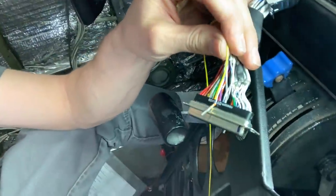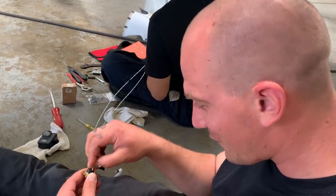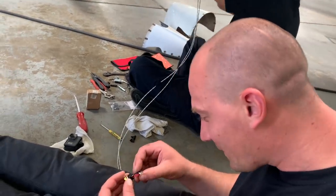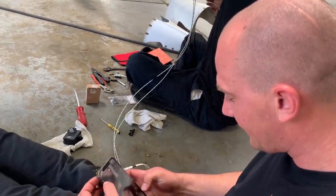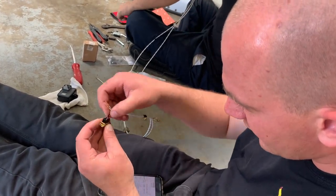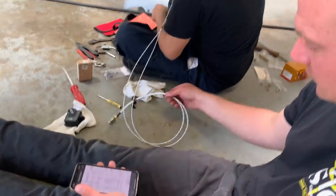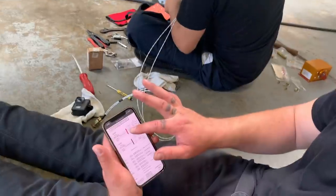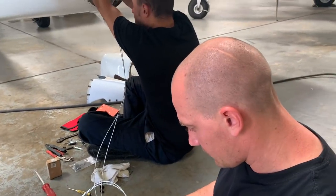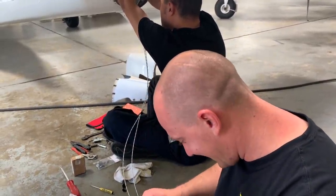Pins five and seven — if you get it wrong, don't yank them out like Jimmy did. You can use a pin extractor tool, it's a cheap little plastic thing, about two bucks, though they wear out fairly quickly. Five and seven is ground — I count out loud when doing this to avoid mistakes. The harness is shielded wire, high quality. Red is roll, black is pitch. The way to remember it: AC/DC — Back in Black — the black goes in the back. R and R — rock and roll — red is roll.